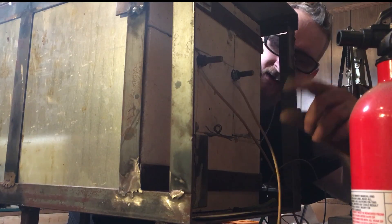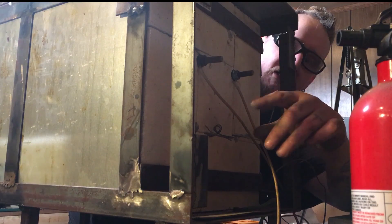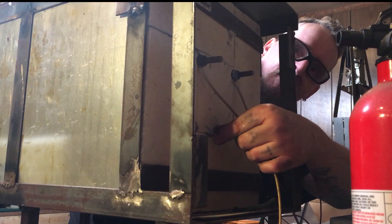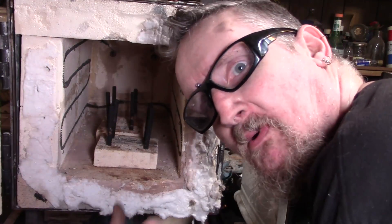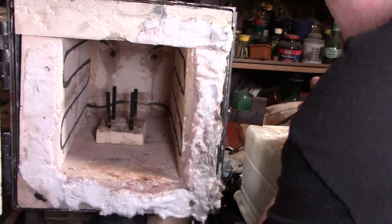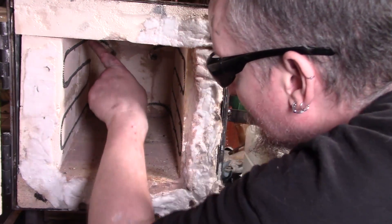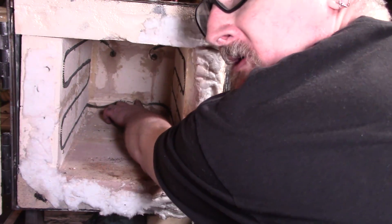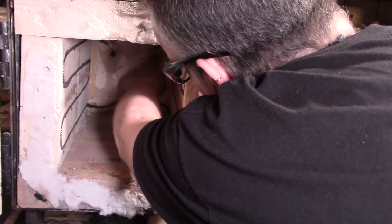Since it's running in series because it's on 220, you connect them both at the bottom — so one goes in, comes down, connects to the other one at the bottom, runs back up, comes out here. Of course I put the top back on, but you can see: one bolt comes in right here, runs up, runs down, connects — the two tie together, then it comes back up here and out. Because it's 220.